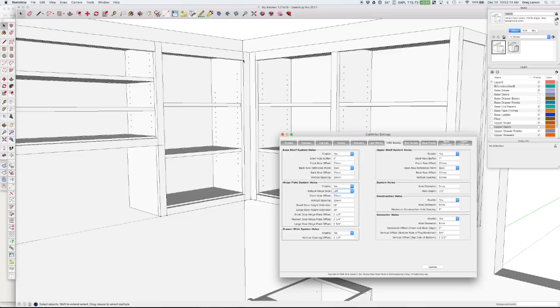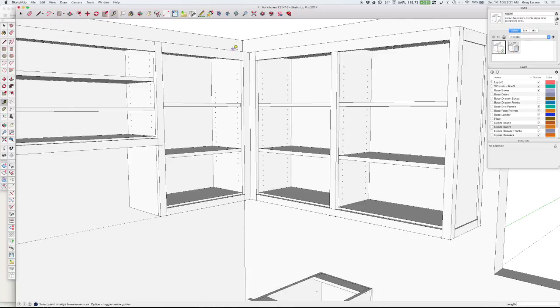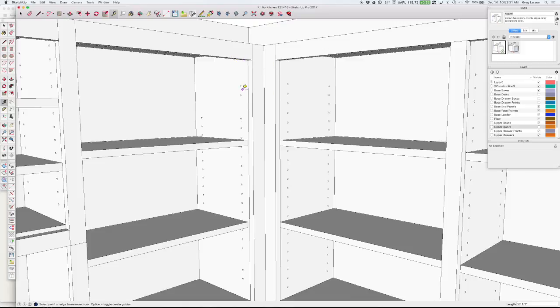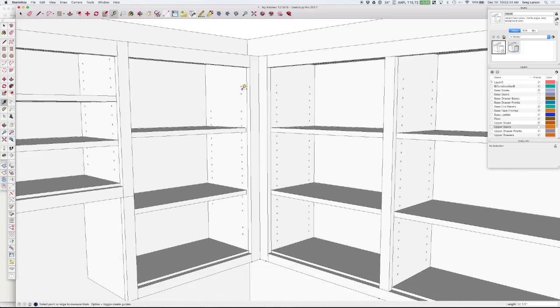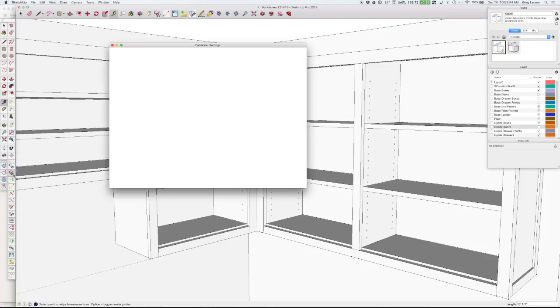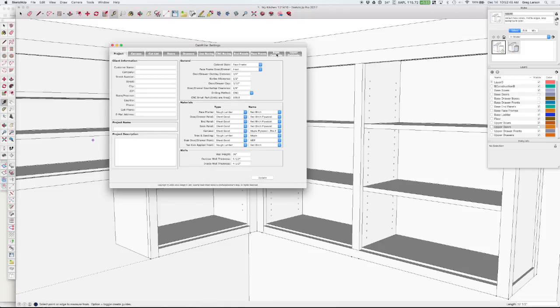If we look at this door, let me close this for a second, get my tape tool, and the tape tool says 32.5, so that should be considered a large door, which means we would be 3 3/4 from here to here, to the center. Whereas on this door, if I change that, that would be considered probably a medium door, and we would have only 3 1/4 inches to the center of the hinge plate holes. So you can control that any way you want.